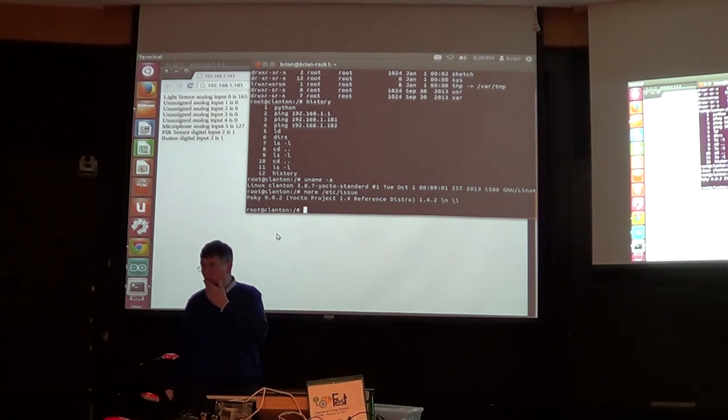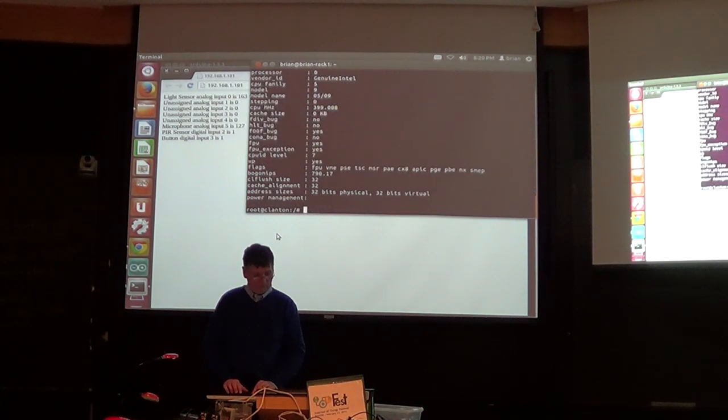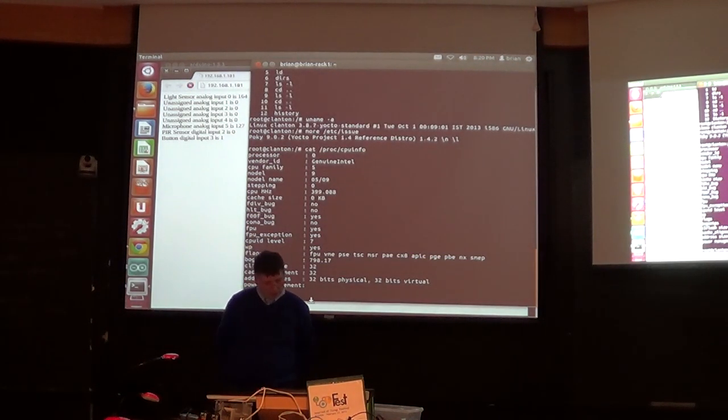Can you show cat /proc? I can. Yeah, just shout them out. cat /proc/cpuinfo. Oh, geez, you guys are good. How do I do this so that you can see what's going on here? Same command, pipe to more. That works too. There you can see it now.